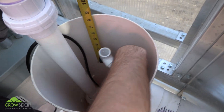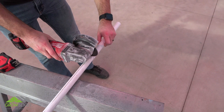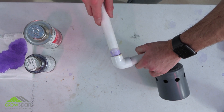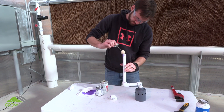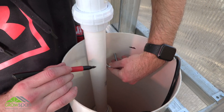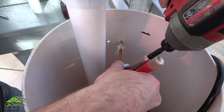The main water pipe length must allow for adjustment of the water valve up or down. Once the main water line is attached and water is turned on, measure and cut the main water pipe from the PVC pipe sent with the kit. Prime and cement the PVC pipe and the elbow fitting to the water supply shutoff valve to complete assembly.